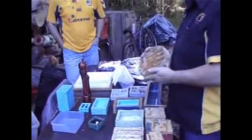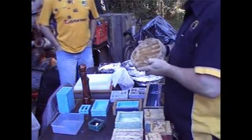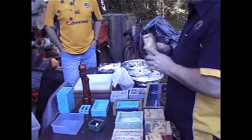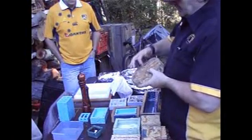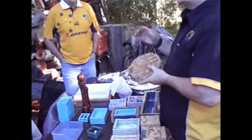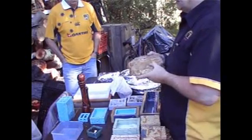This is the first one I ever used. I made 2 of them. It's made with 6 tubes of silicone from the local hardware over a mould, pushed in, and then 2.5 months to set. Takes a while, very slow process. And as I've found with worthless wood, I originally made it to the right size of the blank, but unfortunately you need it bigger than that because under pressure the resin goes down. So I then used a bit more silicone to build up a well over the top. That worked well for 2 years, and it's still usable, but there are better forms.